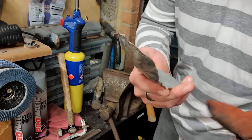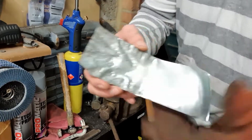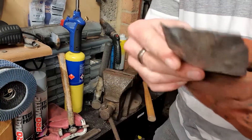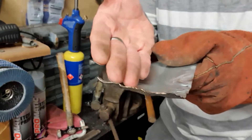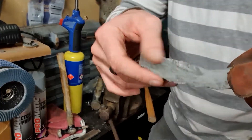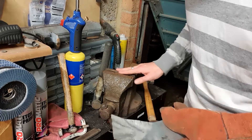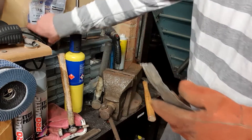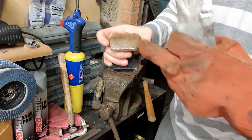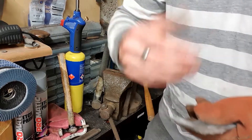It's not a five-minute process with hand tools. You can see the shape is starting to come in — we've still got the flat section there, but the metal is starting to curve up in one direction and also starting to curve up in the other. I'm going to pause the camera to get a dolly into the vice and start to planish out what we've got, to work out how much more shrinking actually needs to be done to bring it up a bit more.